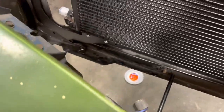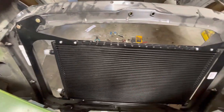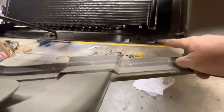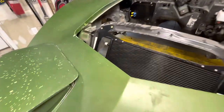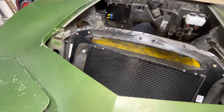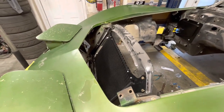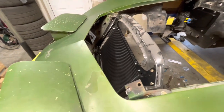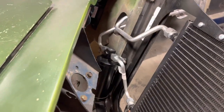I don't like this nut-and-bolt deal — I've got to find out how the radiator fits because it doesn't fit at all. I think I'm going to have to fabricate some hold-downs. All in all the condenser fit just fine — almost like it was supposed to. I do have to drill holes in the bottom. If I were to switch these two brackets, these holes down here would line up right — one's in the middle, one's on the end. This side has to have a gap for the dryer and lines. I also asked myself if I put the core support in backwards — I think the answer is no, I think it might just be incorrect, so I've got a little homework to do.